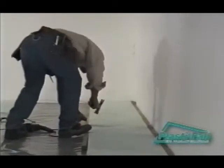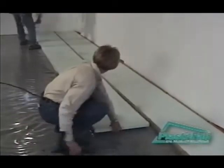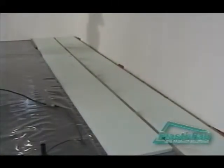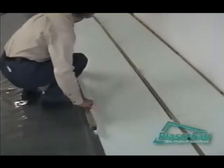After the first row of strapping is in place, you can begin to lay successive rows of insulation and strapping. Cut the remaining rows of PlastiSpan insulation to 22-1/2-inch widths — you can use these as guides in placing the next rows of strapping. Remember to frequently check that the strapping is always on 24-inch centers by measuring from the inside edge of the previous row to the inside edge of the new row.